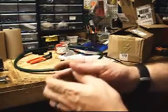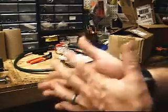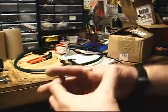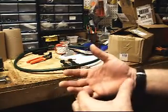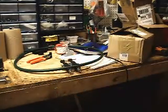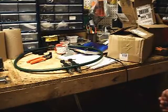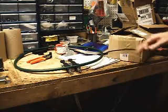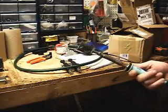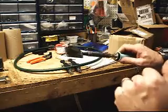If you run that iron through and it's hot, and that green belt is, instead of just slowly bubbling, it just starts sizzling, that's not going to be better, because it's too much heat. I've done that before, and it got me through the league night, but the weld needed to be repaired later on. So if you got time, as soon as you start a green round belt repair, especially if it's on a league night, get your iron plugged in, get it preheating up, so it'll be ready for you when you go to use it. Yeah, I can feel the heat coming off of this one pretty well.